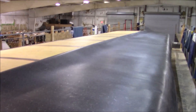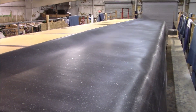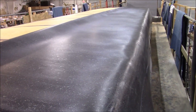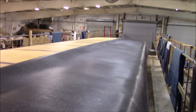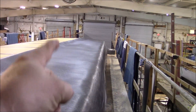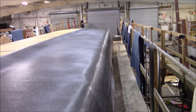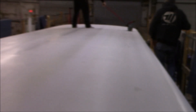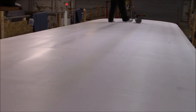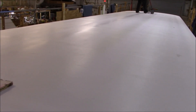You'll see another one coming up — a Lazy Days — that one's a hot mess with lots of work. The next clip will show it pretty much all together because we're almost done. Once we roll it, we'll cut the holes for the vents, AC, and skylight, then mount the curbs and heat weld them in. We've also got an awning rail system to install — the original was on the side and was impeding water flow, so it needs to go on top. We're rolling it out with the big roller, then we'll rock and roll.